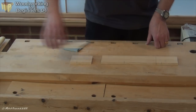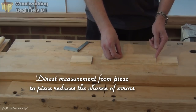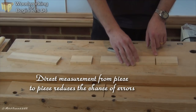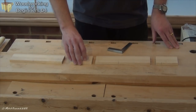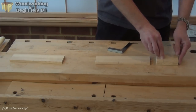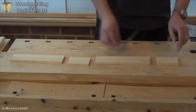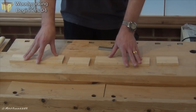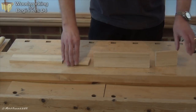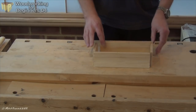Now use the original side to mark the length of the opposite side. Use a knife to mark the end and saw that nice and square — you've got two sides exactly the same length. Then use the original first end to determine the length of the other end. Knife that, use a square, and saw that nice and square. Then you end up with two sides exactly the same length and two ends exactly the same length. You can put them together in a box by wrapping them around, and you'll keep a grain match on three of the joints.